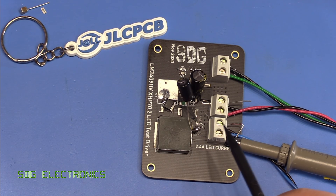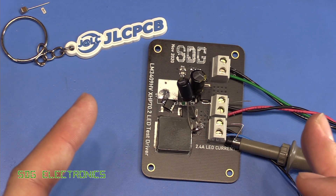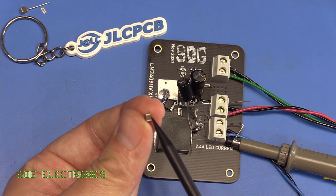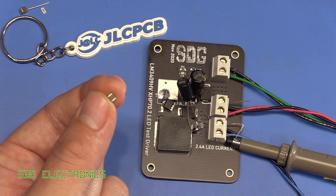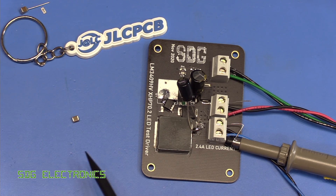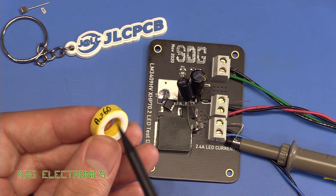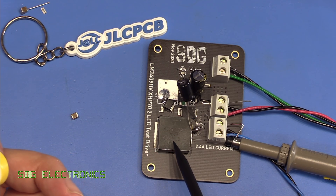That's really quite an interesting outcome — I was not expecting all of the sound to be coming from the ceramic capacitors. It just sounded too loud for it to be coming from those. But the main thing is they are physically large and the layers are also quite large, so you get quite a large piezoelectric effect and quite a lot of sound. Sadly we didn't get to wind an inductor because it turned out to be pointless — I was hoping to use the LCR meter to wind an inductor, but it turned out not to be related to that whatsoever.